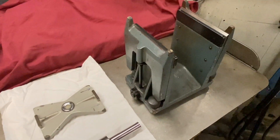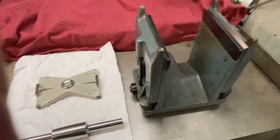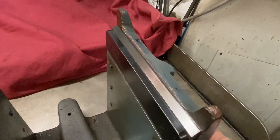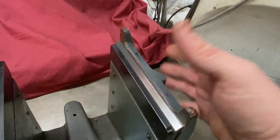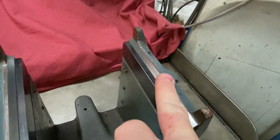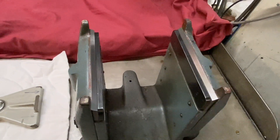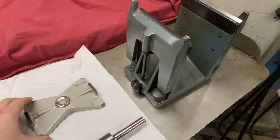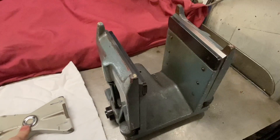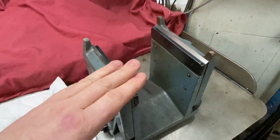Up until fairly recently, I used to use a knife edge balancer. These are a normal piece of kit in a machine shop, used for balancing grinding wheels. They consist of a nice sturdy cast iron body with movable side protectors that enable you to put the mandrel on and then lower it gently onto the knife edge. These are precision knife edges, ground perfectly flat and free from blemishes. In use they do get damaged — this particular unit has had one regrind. You also need to be able to level it. There's a leveling platform with a bubble on top, which enables you to set it up nice and level so when you put your flywheel on, it won't roll off one end. That has to be perfectly level to be used accurately.